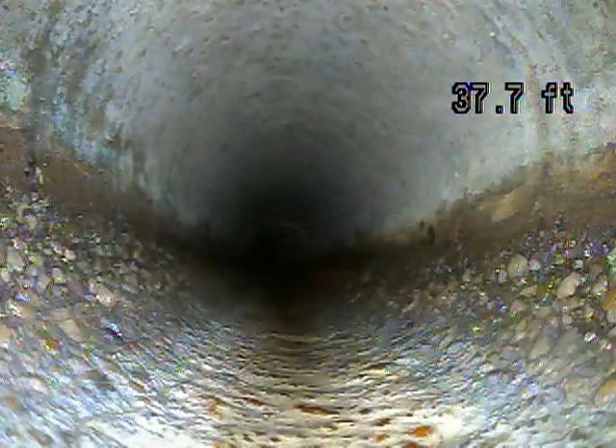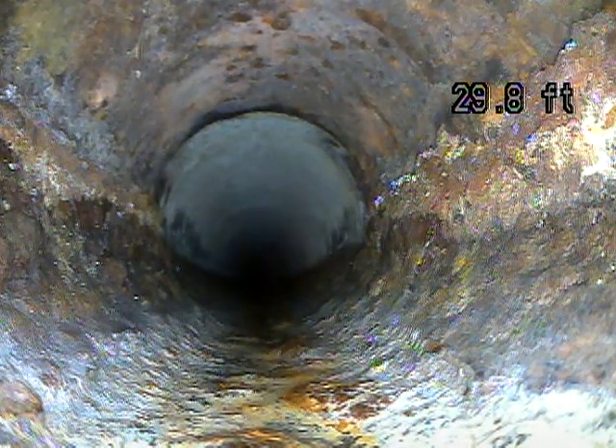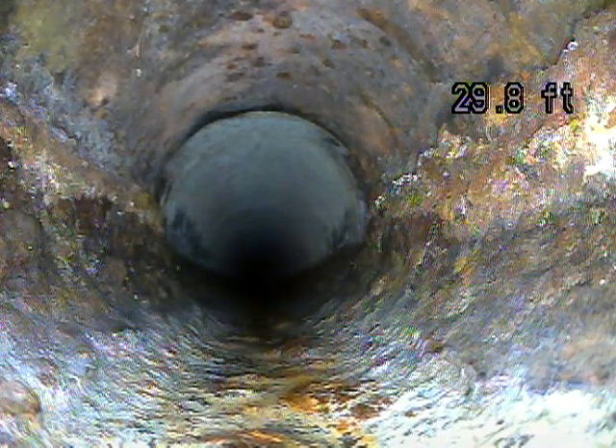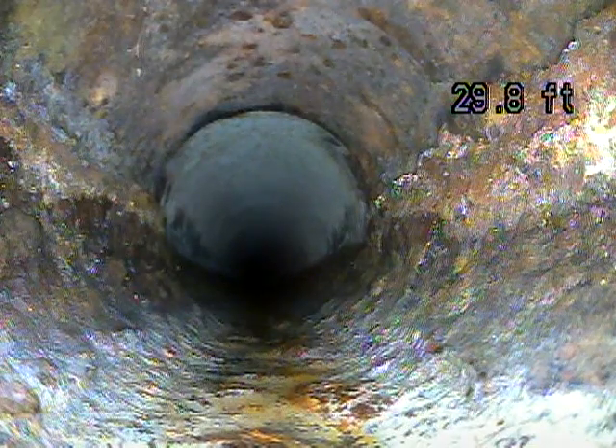Another offset. It is a good sign that you don't have a bunch of waste built up around these offsets, but they're not ideal and also something very costly to dig up and repair. If you do one or two, you dig up one part of the pipe and have to do a spot repair. There's no way to do it trenchlessly.